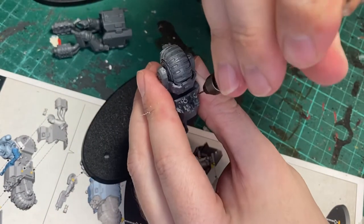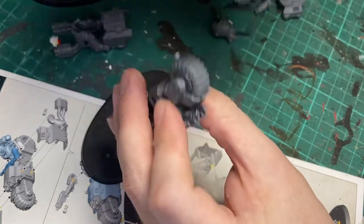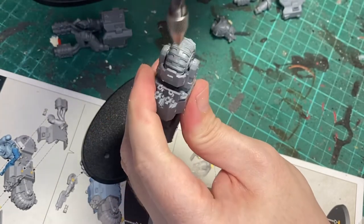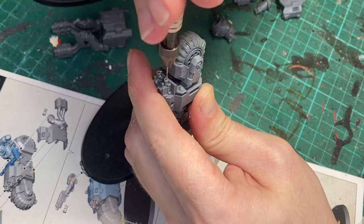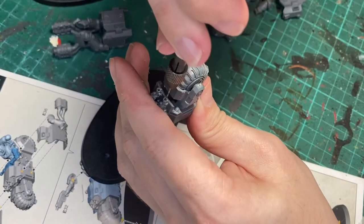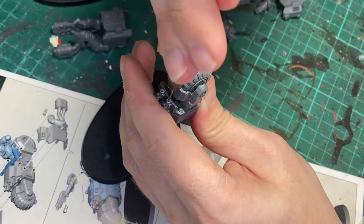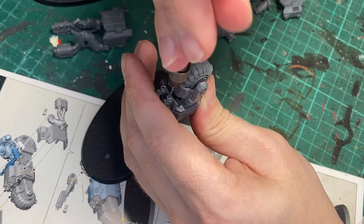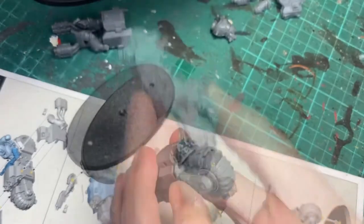This one — the one I made previously — I think they are nearly there. Take a little bit off. Remember what you're trying to do is you're trying to ream that hole bigger just using the side of the drill bit. You've got to go gentle with it because the drill bit will snap if you're not careful.